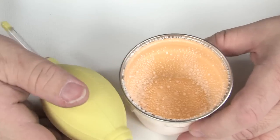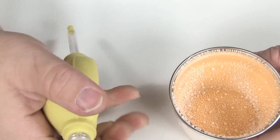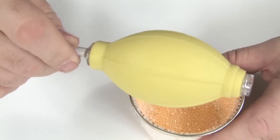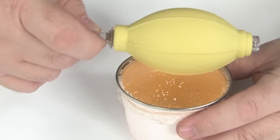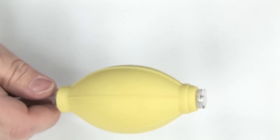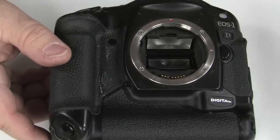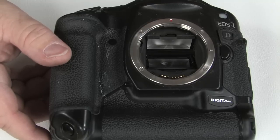Another thing we found out with all this testing is that when you squeeze the Z-Ion with dry hands — my hands are kind of moist so it won't be as good right now — but with good dry hands, your skin against the silicone creates a static charge on the silicone. So just holding the silicone blower over the pellets, you can see the pellets are actually coming up and attaching to the plastic. This charge is a problem because we've measured it to be at 14,000 volts. Getting that type of voltage near the contacts that most cameras have for talking to their lenses, and being induced into there, could damage a camera. So I'm not sure that we should even be using silicone blowers at all.